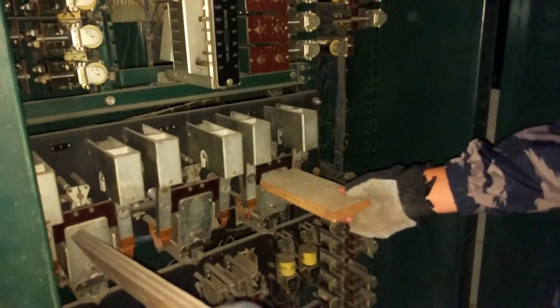The brake is not releasing. On this, somehow, the brake release contact doesn't work. So if I release the brake manually, then... On this lift, the brake solenoid seems to be stuck. So the only way we can drive the lift is for one person to manually release the brake as someone else presses in the main contactors to give the motor power. Release the brake. There it goes. I have to release the brake manually.